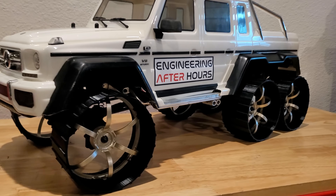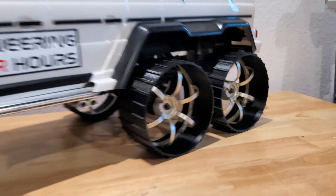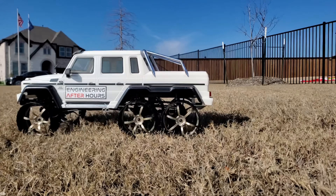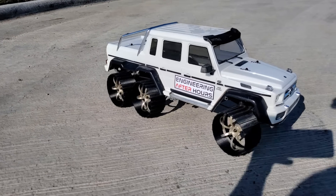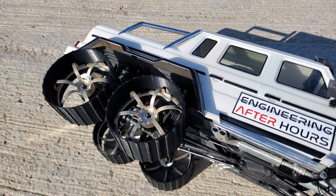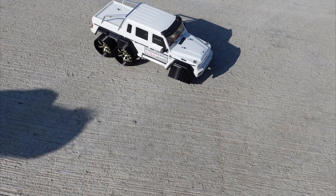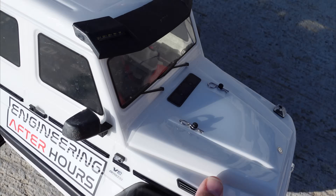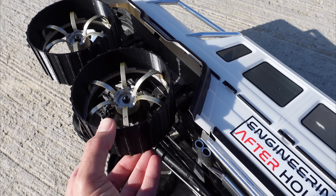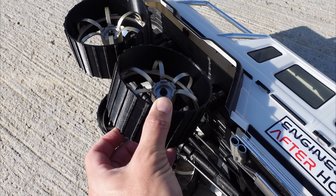On a side note, we also made Mars rover wheels and they looked awesome. We thought these were going to perform really cool and we wanted to compare them to the slinky wheels, but they didn't last at all. Look at how terrible they perform under moderate acceleration. The only thing that worked was the leaf spring mechanism — it actually did what they're supposed to do on the real rovers. One of the problems with this type of wheel is it has almost no moment stiffness laterally, which is why it's so easy for it to contort and bend.